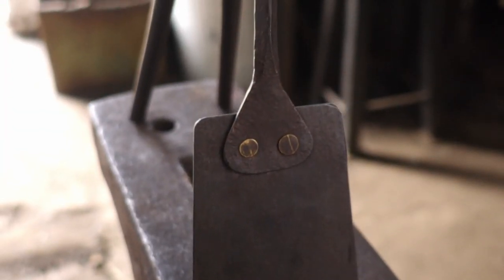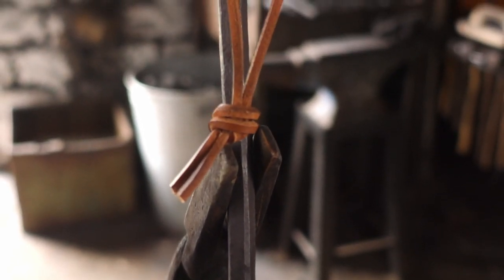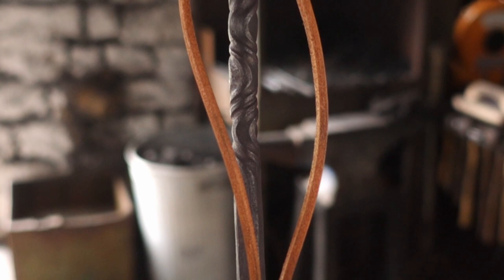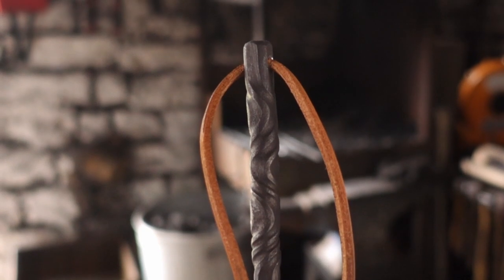I should really think about buying some little rivets for this, because those brass rods are a bit tricky to do — you have to heat them up and then you lose your heat. It can be a bit of a nightmare because they're so small, it's 4mm round and it's all fiddly. I should really buy some proper copper rivet heads; the copper ones I should be able to do cold, whereas the brass was cracking in my past experience. It's a nice little spatula in that same medieval style with a nice little reverse twist on the end — all black, natural finish. Thank you for watching, I hope you enjoyed it and I'll see you soon.